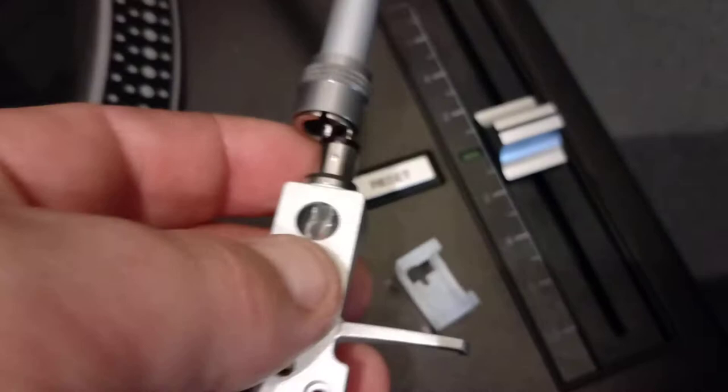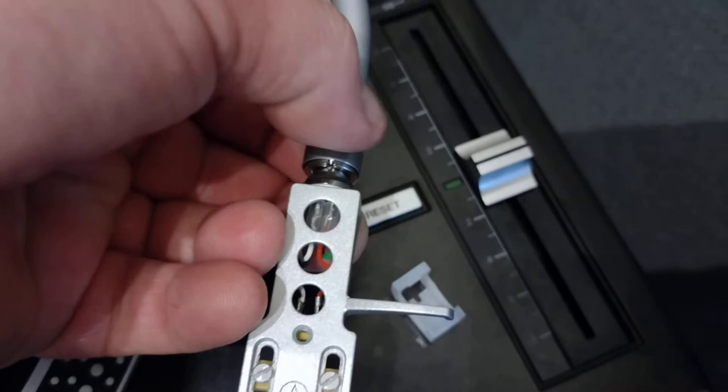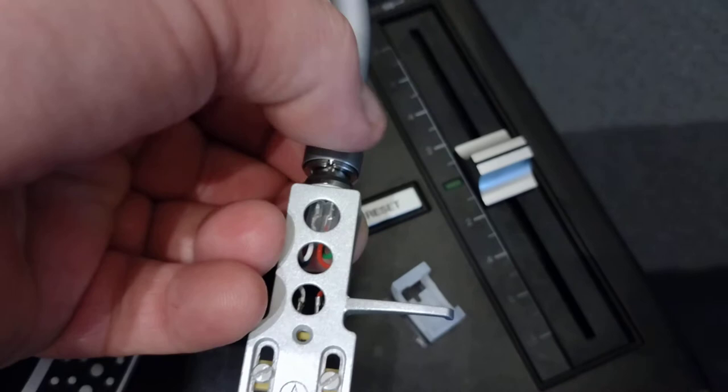When you put your cartridge on, put the cartridge in first and then push back on it so that it is actually undoing it. You'll get a clunk, then do your cartridge up — you'll get a much better seat on there. Once that's done they sound much much better, but just remember the table will only work on phono mode. Hope it helps!